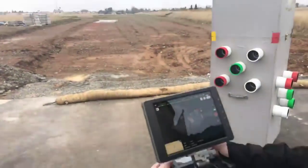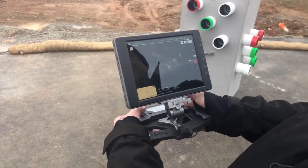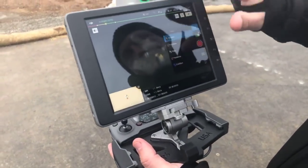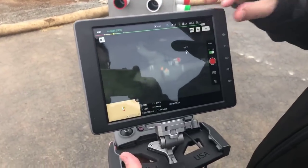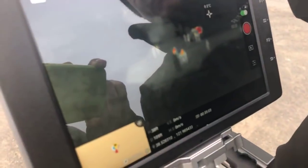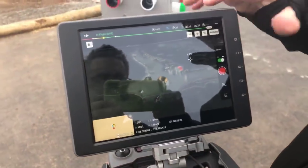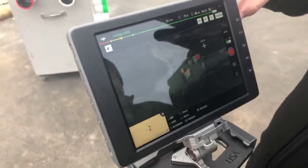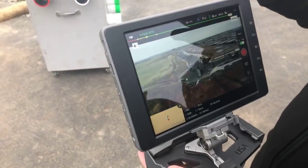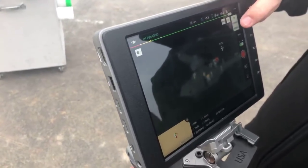Let's go about 100 feet away. So we're 100 feet away, 40 feet up. Let's stay in hotspot — this is what it looks like without Fusion on. We can still see the hotspots, we can still see the shapes of individuals. If we now put on the Fusion, we immediately get a much clearer picture of what we're looking at. The Fusion to me is an essential piece of this platform — it really allows you to have a smaller thermal sensor and still get really good data. People were concerned about the size of the sensor, but when you have MSX or Fusion on, you get a significant amount of information on screen.